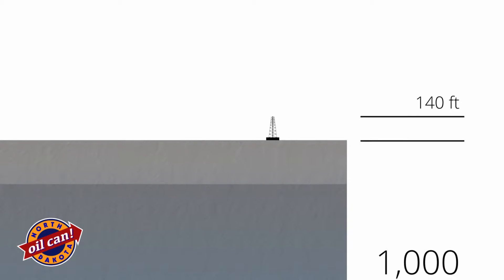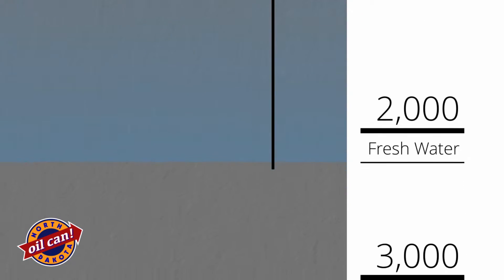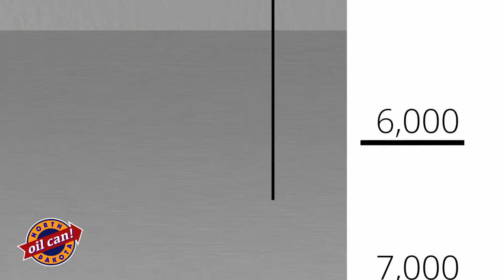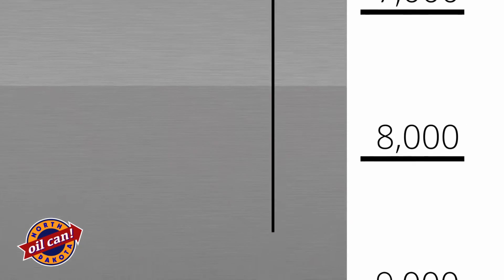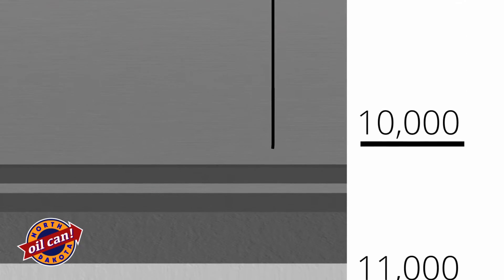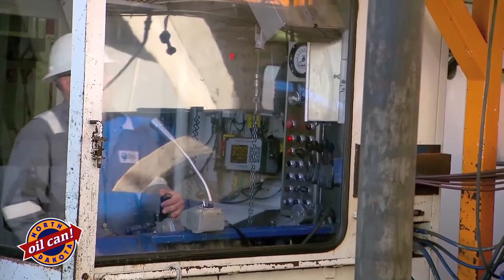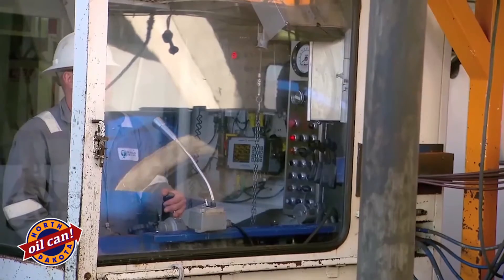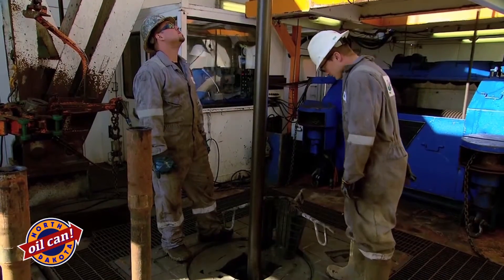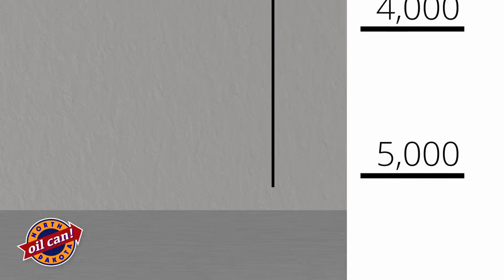But how do you do that? We drill vertically from our surface hole down through our formations to a kickoff point. The kickoff point is where you change from vertical drilling to oriented drilling to drill the curved portion of the wellbore to land in the middle Bakken. Now you still have to wonder — how does that drill pipe bend and go from a vertical orientation to a horizontal orientation in the middle Bakken?